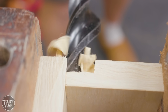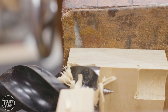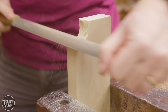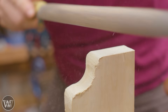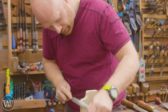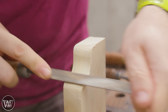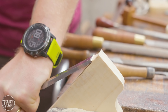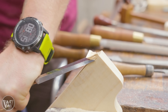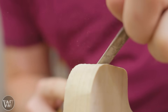I'm going to put a sacrificial block on here and drill off the corners to create rounds — I'll just let it blow out a bit because we're going to chamfer and clean that up. Then I'll hit it with a rasp and round over all the corners to make it comfortable. For the last square corner I'll use a chisel because it's a little larger and slightly faster. After the rasp you can work through progressively finer files. For the large corner on the bottom, chisel it off and then detail it down with a rasp or file — really fast and simple.